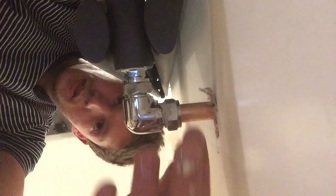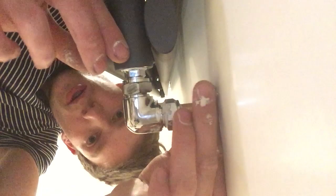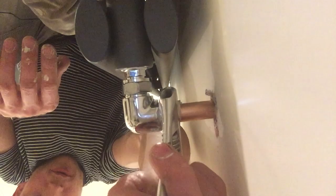You should have a very strong joint. Just before you tighten it, push in any extra slack in the pipe so that all the pipe that can go in, is in, and then do the final tightening over the jointing compound. Turn this nut until you start getting resistance, holding about 10 centimetres away from your spanner, then give it a quarter of a turn from there. If it's not fully sealed, just pressurise the system — if it's leaking, tighten a tiny bit more. But if you over-tighten and it leaks, you're stuck, because over-tightening squashes the pipe. If it's under-tightened, the olive isn't gripping down enough to close the gap, so a little more tightening will close it. A little is better.